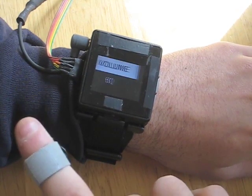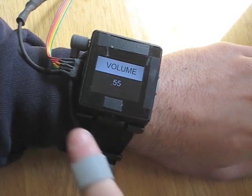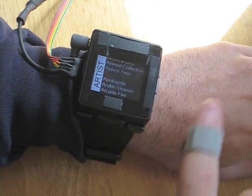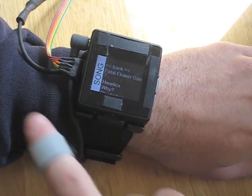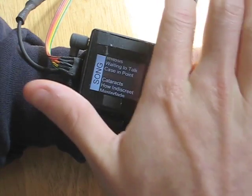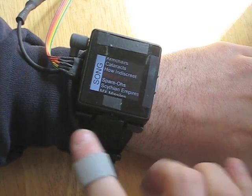Users can click by flicking their fingers vertically. This feature relies on the dipolar property of magnets. When a fingertip moves below the sensor plane, the magnetic field inverts. This flip is captured by the sensor and interpreted by our software as a click.